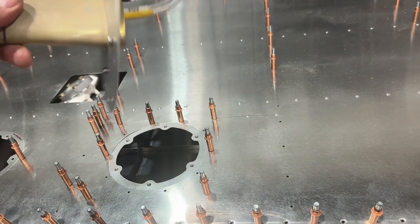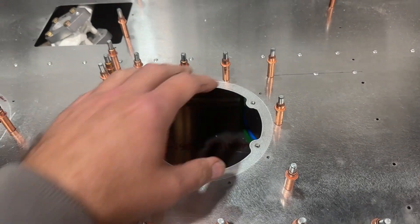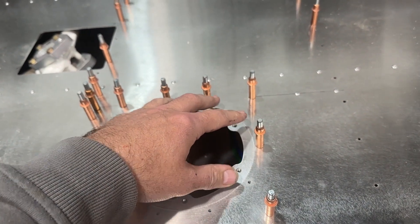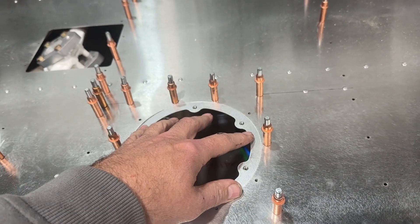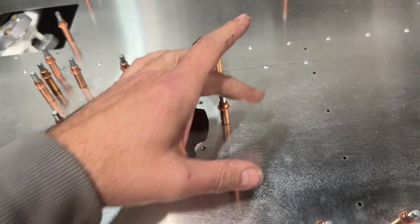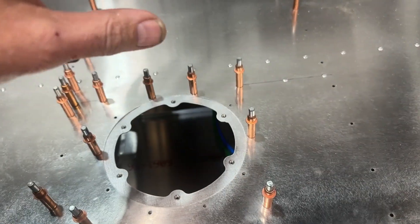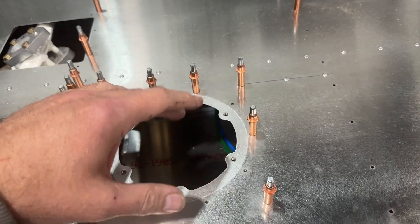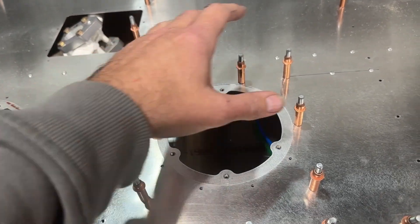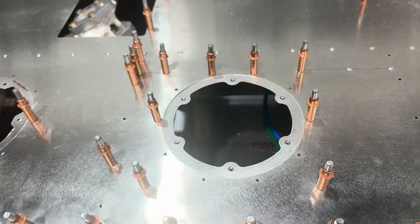You can't just take this and mount it to the inspection cover because these covers are only 20 thousandths. They're very flimsy; they're not structural. So I knew I had to come up with something different. Also, the skin around this area is very thin, and you couldn't just expect — even with a thicker cover — expect that to work. So I did have to come up with a way to increase the strength in this area.